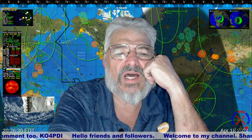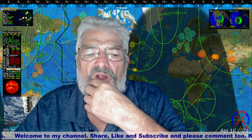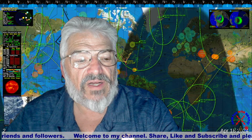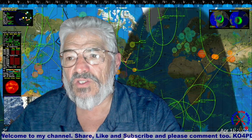Well, I don't know what part of the pass you were listening to, or how many watts I was putting on. Oh yeah, everything's got like no SWR on it. As a matter of fact, I can actually check that. Let me turn off the control, hit that, go to FM, and put the meter on the screen. And I'll key the mic. SWR on the 2-meter antenna is 1.5, or less than 1.5 actually. So yeah, the SWR is fine.